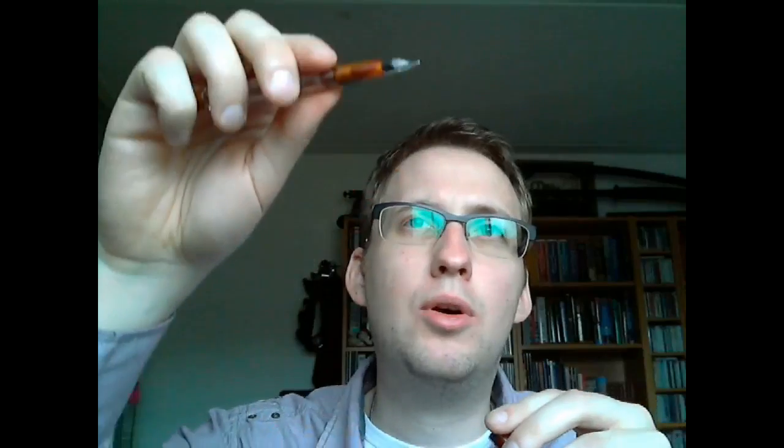Okay. What you can get from a lot of sources are very fine, very thin sheets of brass. You can use those to floss the nib tines. And that works fairly well. You can smoothen them out a bit, and I think that the brass is mainly used to open them up a bit, because if you have the tines of a nib, you hold it against the light, you should see a small beam of light that passes through the tines. Now if that is not the case, the two tines may be too tightly together. If you gently put a sheet of brass between the tines, you will open them up.